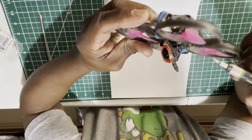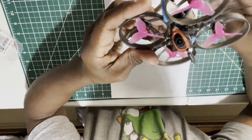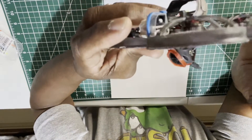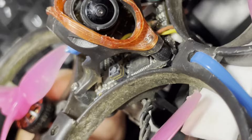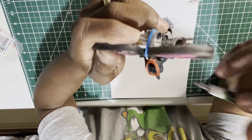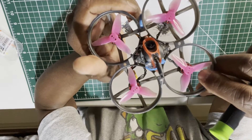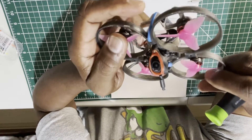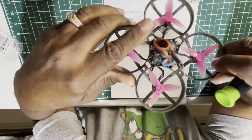I'll point out where the ceramic antenna is located. There is a trace around it, and what happens is when this thing hits branches and trees and crashes, the traces on the ceramic antenna for the ExpressLRS get scarred or cut. That obviously affects the antenna and definitely lowers your range. So instead of trying to replace that little ceramic — which risks damaging the board — you can put an external receiver on it, and I'll show you how I did that with the wiring.